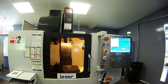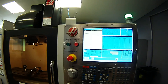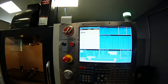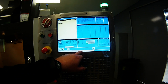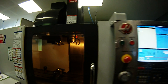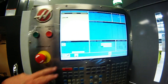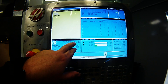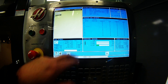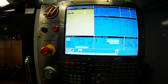We've come to the end of our spindle warm-up program and we're on the last line of code. The spindle is at 10,000 RPM with about 170 seconds to go. To verify that speed, if we look at the spindle speed readout, we can see 9,900 RPM — holding very closely to 10,000 RPM and only using 5% of load.